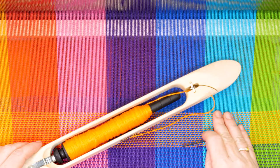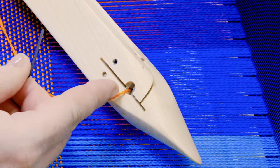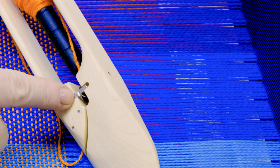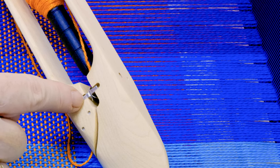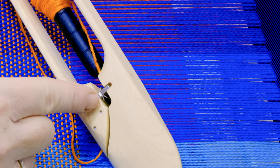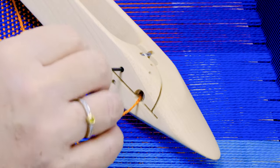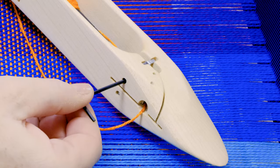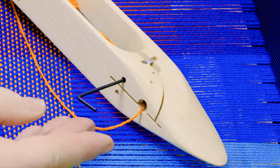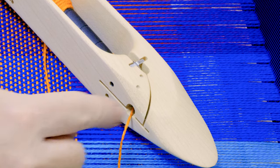There are many adjustments that you can make to your End Delivery Shuttle, but the most common one is right here, which adjusts the tension spring inside. It's going to control how much force is pushed together or pushed apart. In order to loosen the tension, you would stick your Allen wrench in until you feel it find its spot. Then you would gently, with a very small turn — maybe an eighth of a turn — unwind. Then try to pull your yarn out and see the difference in the tension.